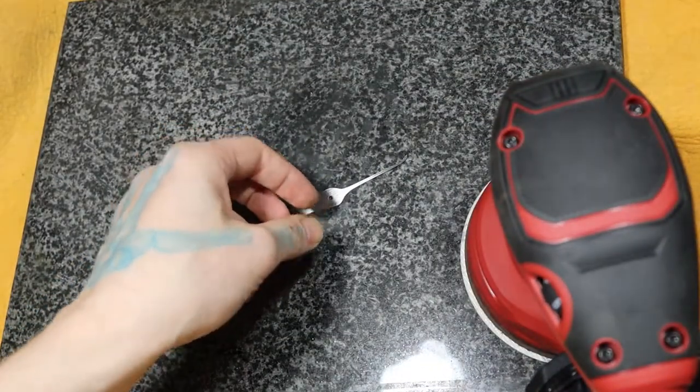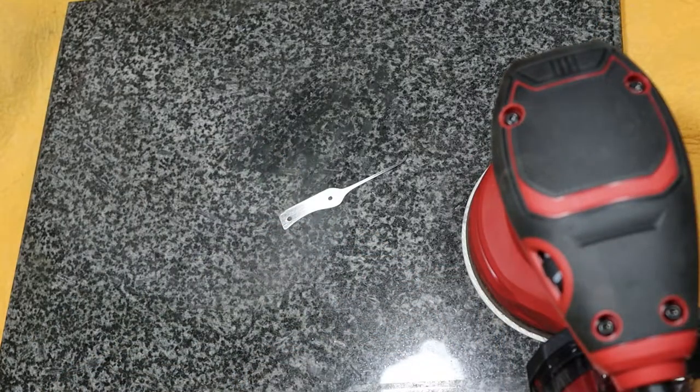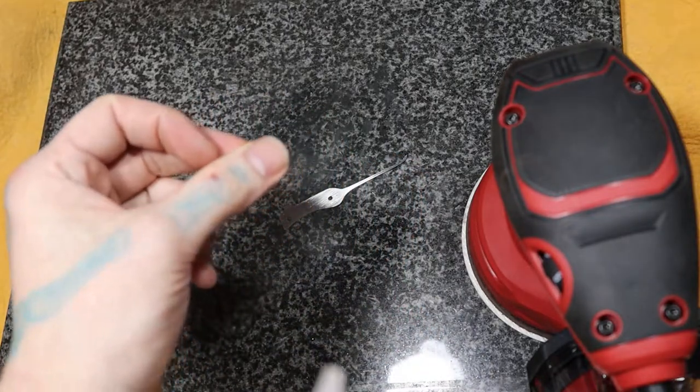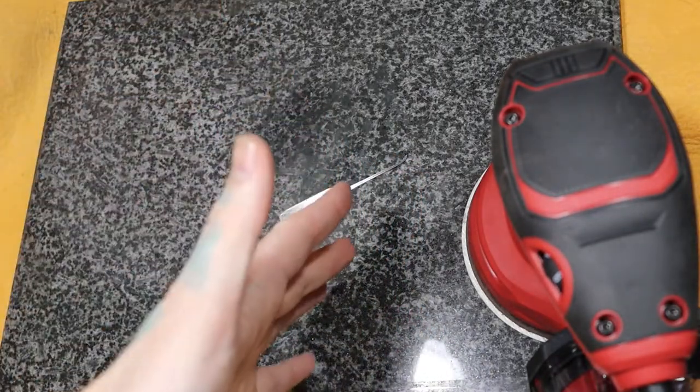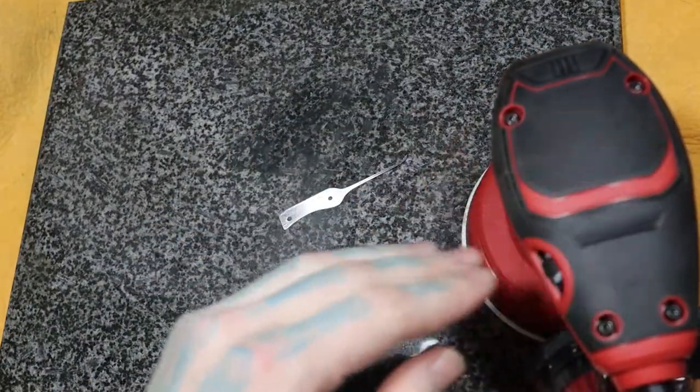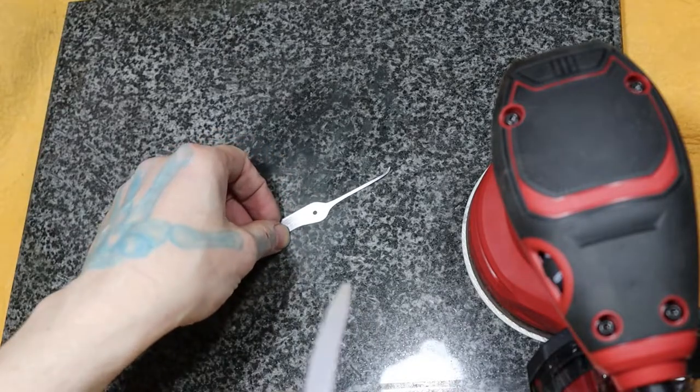And what we do is we put our sandpaper on, which I take up, me personally, to about 1200 or 1500. And you don't have to do every single grit going up. You can start at 400, then do 800, and then do 1200, and kind of step it up like that. Because remember, it's a power tool. It'll do some of the work for you.